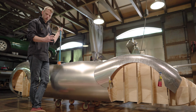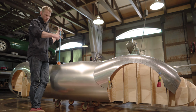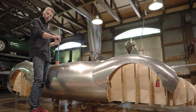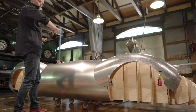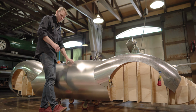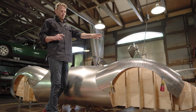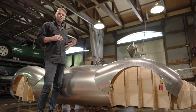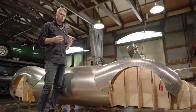So that is a quick look at how this barrel side is initially shaped. The next steps will be to cut the door opening, and then make the recessed flanges for the door skin itself. But that, at least for me, gives me a guide on where the front and rear inner fenders are going to land. And that's the reason that I wanted to jump on and get this part installed. So next video, we will make the inner front and rear fender. And the unique thing about shaping those is they have a reverse curve, which is typically one of the more complicated things to do in metal shaping.